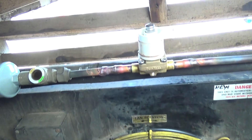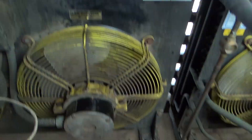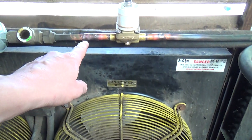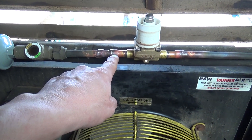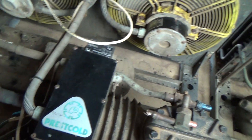What I do with these is I usually cut one side off really tight — that little stub that's there — and then I join onto it. Then the other side you can cut just the other side. Otherwise you end up having to unsweat it and put bits of pipe in there and all sorts, which ends up being a pain.